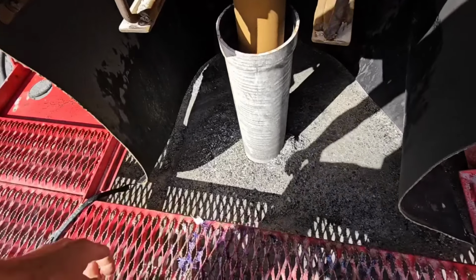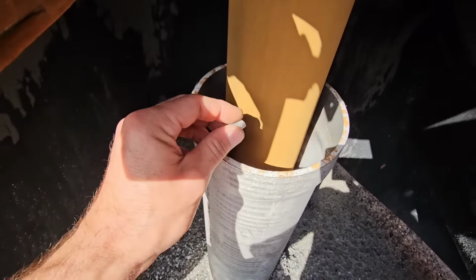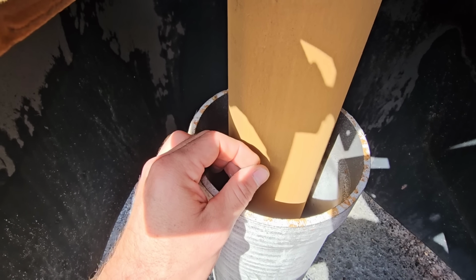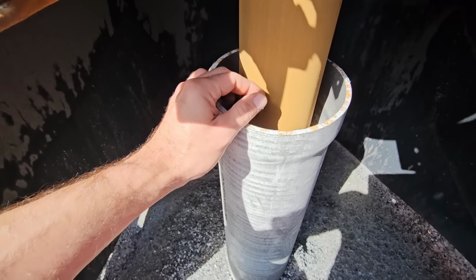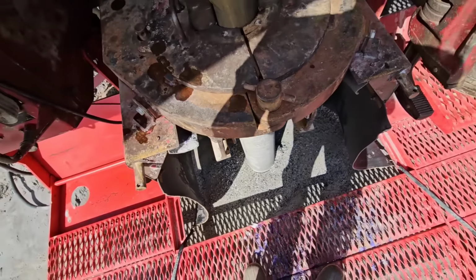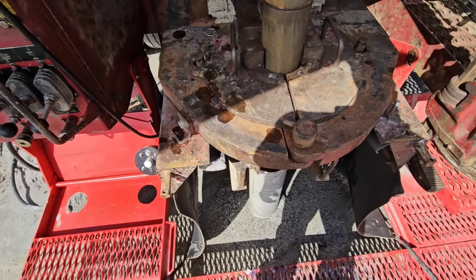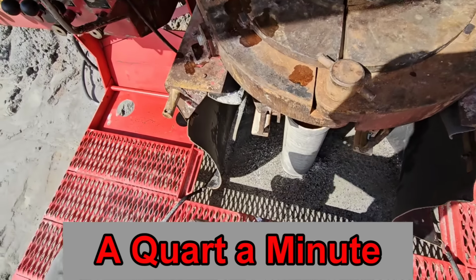This well didn't make much. We're gonna find a tiny little pebble like this and we're gonna drop it and we're gonna listen and count. Six seconds to water. So 120 feet to water. Yikes. At least it's made some. It's made like 300 gallons in, I don't know, 16 hours.